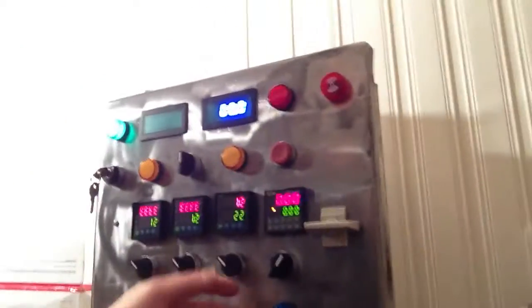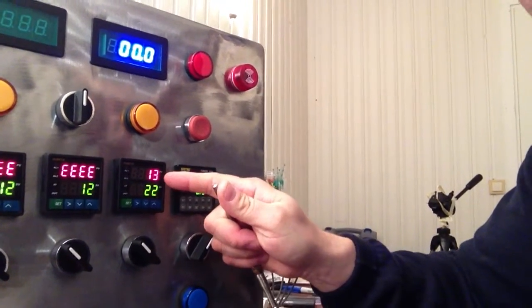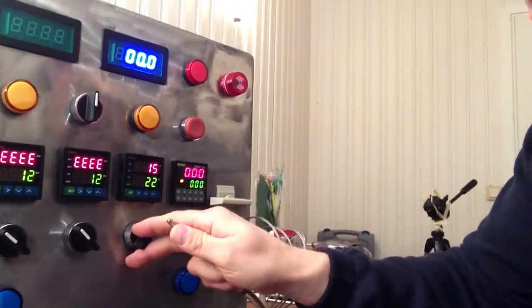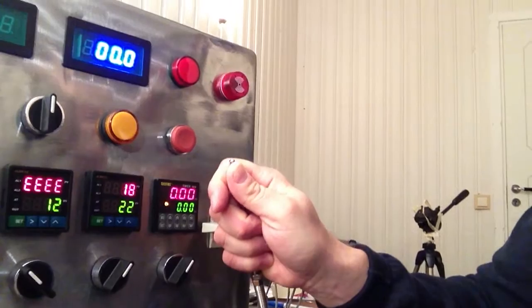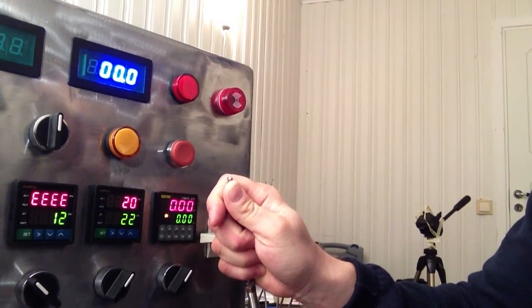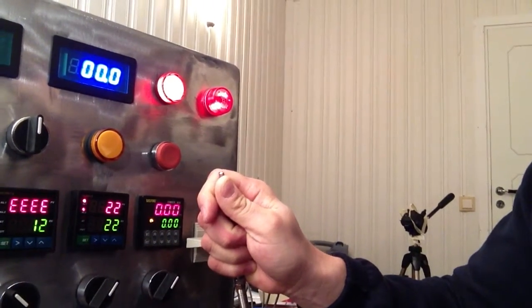So how does this stuff work? I'm gonna put my hands on the thermocouple and you're gonna see the temperature rise — see it's 13, it's gonna go up to 14, maybe straight to 15. Then I'm gonna turn the alarm on. The alarm is right here and we want it to go off and sound the alarm and the light to go off when it gets to 22. There we go — yes, we've got contact. I'll let go of the thermocouple and turn the alarm off. Progress — it's working.